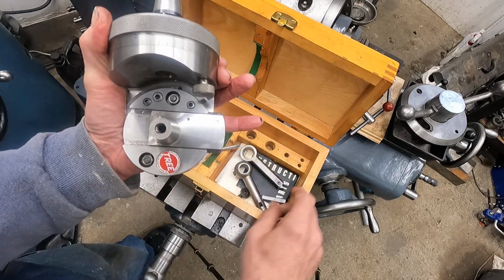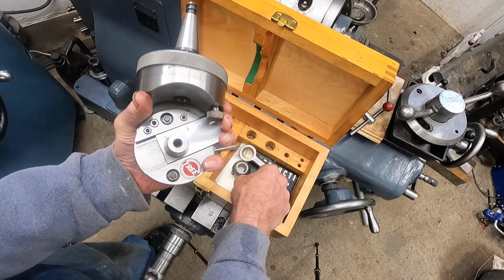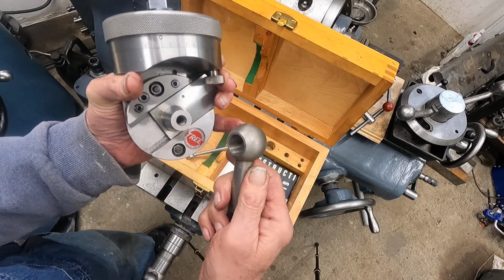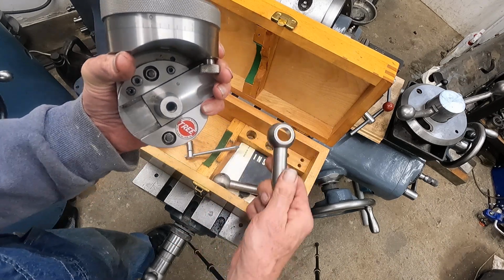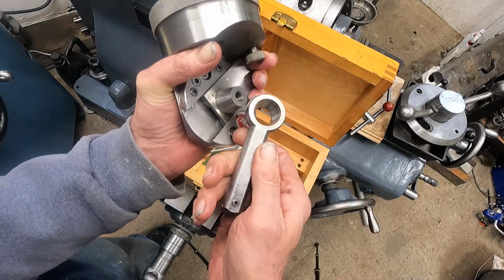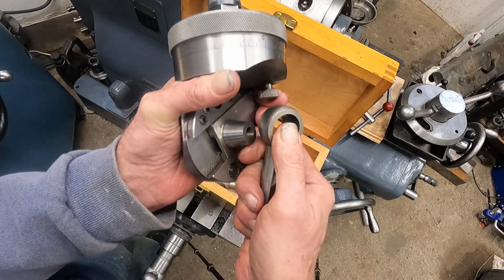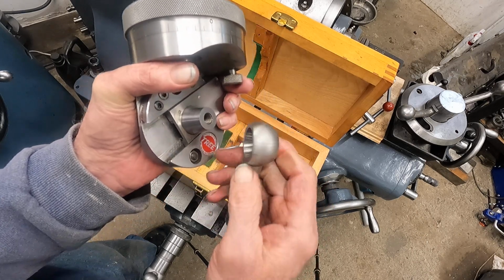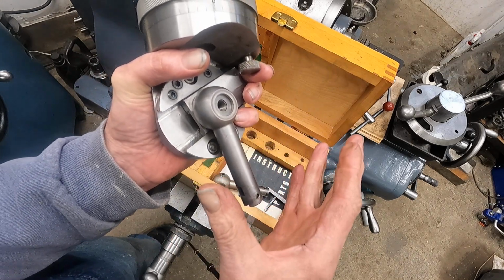Okay. Well, I hope I'm not confusing everybody on this thing. It has a lot of options, and you can cut bevels and things like that. Oh, I just saw how that one works, and I'll show you. Now the way these tool holders fit on here is with this taper. But that doesn't mean you have to use this. You can cut a taper in a piece of steel and braze a piece of carbide on it, and shorten something up, make something custom.